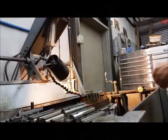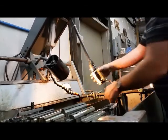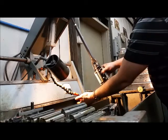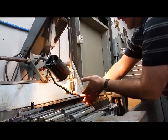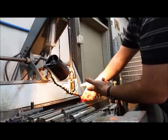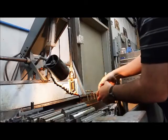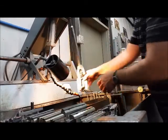There are a couple of tricks to honing. The honing stones are porous and need to stay very clean, so we use honing oil - a pretty thick base oil mixed with mineral spirits like paint thinner, which thins it way out. It's used to lubricate the cut while it's happening to prevent excessive friction, to cool the cylinder as heat builds from friction, and most importantly to clean the stones. The mineral spirits keep the stones from loading up with the debris being removed from the cylinders, so all those very fine particles don't pack into the pores of the stone.